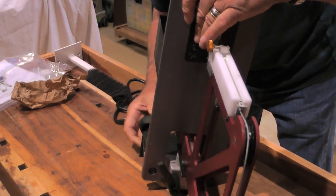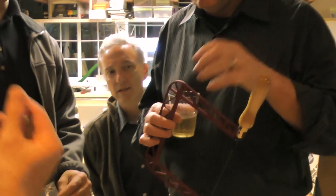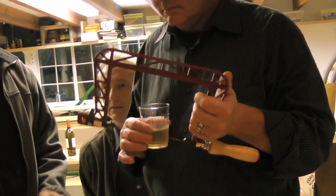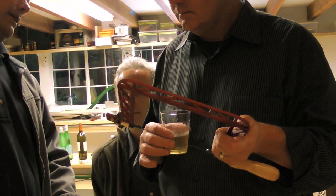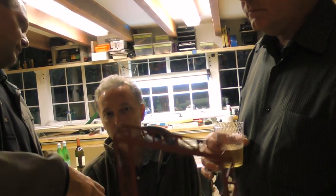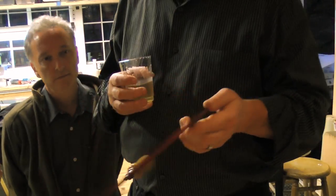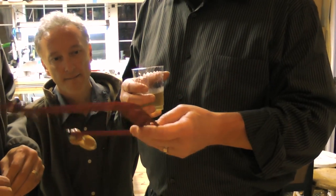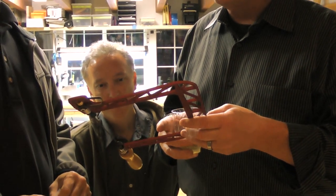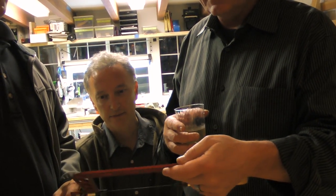No, what I really wanted to show you guys was this. That's a longer one. The stiffest coping saw in the history of the human species. Try that. What's the difference between a coping saw and a fret saw? Do you want the blade thickness, the width of the blade, the length of the blade, and the typical depth here? And with fret saws, you need to grab the blade by pinching on it. You see, these blades have little pins in them. Right. Did you design this? Yeah. Okay, so here's the deal. What you're doing is so smart because this is how it should have been made from the beginning, but the technology wasn't there. Yeah. This is fantastic.